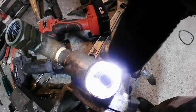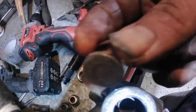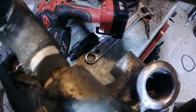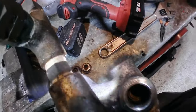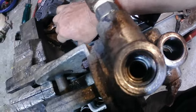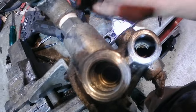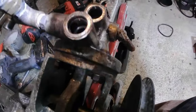Alright, so I got into the pump head, took out these valves. There's these little non-return brass little flappers, so they were all seized, but they can be cleaned and put back in. That's no big deal. We can clean up the seats, lubricate that. There was also a little filter in there, which was blocked solid, so that wouldn't have worked either. And we've got another problem with this pump now. So that's all, the head's all serviceable, no problem.